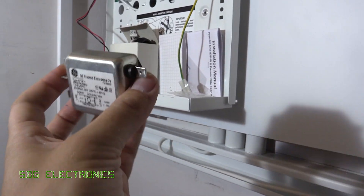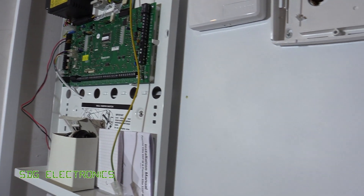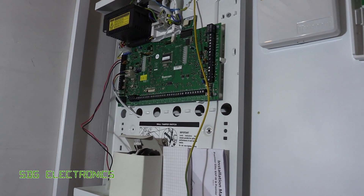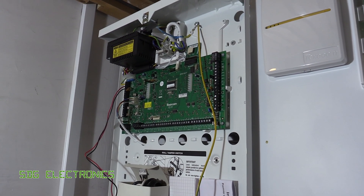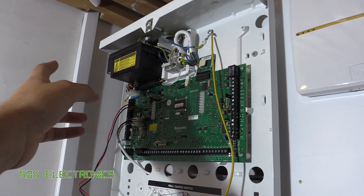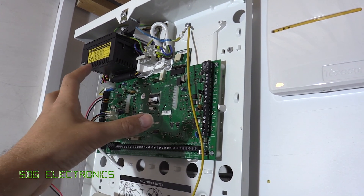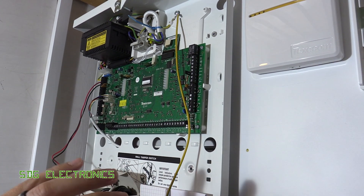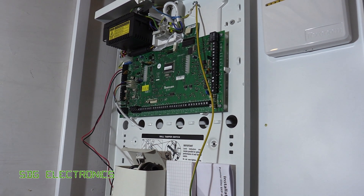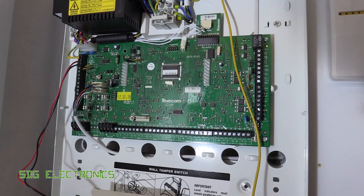What I've done is bought one of these little EMI filters, and I'm probably going to stick one at the top as a mitigation to try and stop anything happening. It will have its own circuit from the consumer unit, but in my opinion this is all pretty poor — it suggests that any common mode noise will just make its way straight through the power supply onto the board and make it very easy for the device to false trigger.